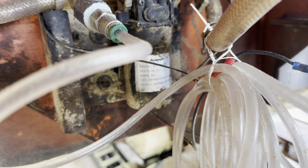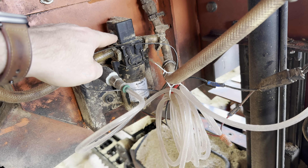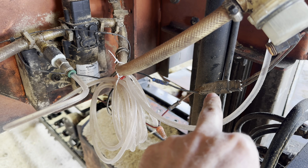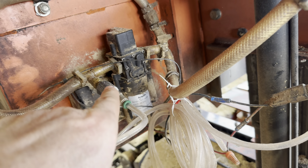I've been running this pump for about two years now — this is not the original Wood Mizer pump, but before I told anybody it would work, I wanted to test it for function and longevity. You can see it plugs in exactly where the Wood Mizer one went. The only thing you've got to do is leave your connector like it is, cut the two wires in the back, and plug them into the wires on this. Do not cut your connectors and wire them together — leave it like it is in case you ever want to put an original Wood Mizer lube system back on. This is a direct replacement for your lube miser pump.